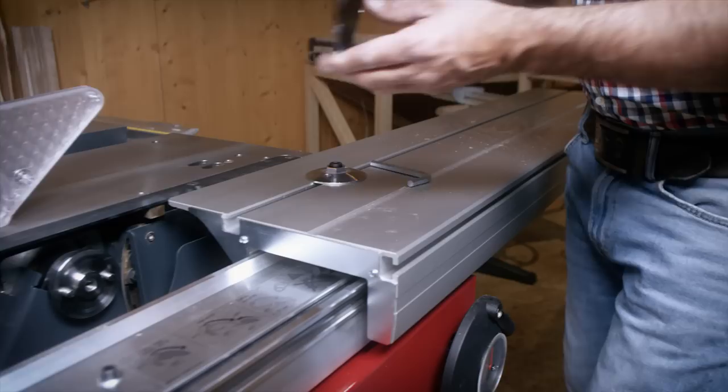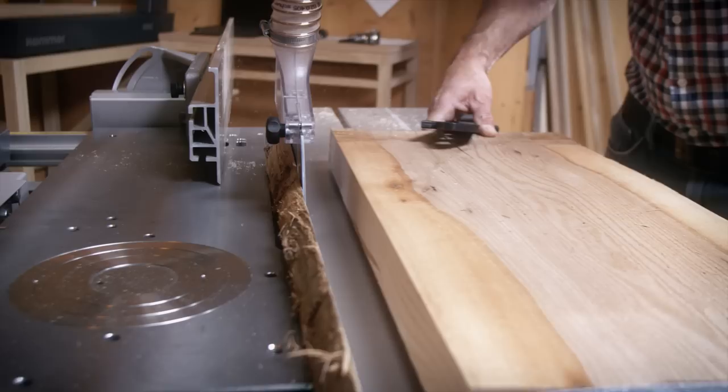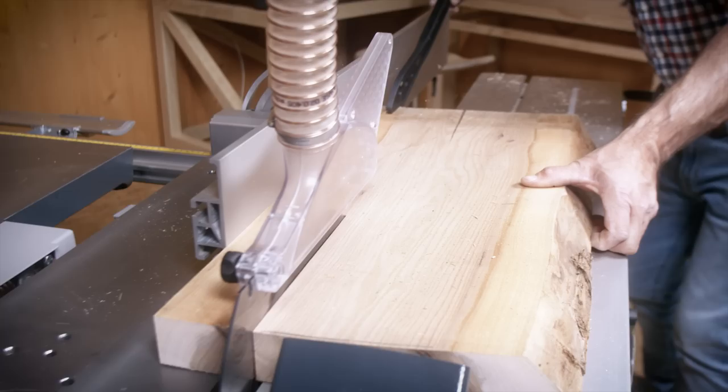Our C331 converts to trimming in just a few seconds. As an allowance for the width of the boards, we add about 5 millimeters. Important! We think of our reference pieces now, as they make it easier for us to carry out various adjustments later down the line, for example when performing test milling or checking fits.